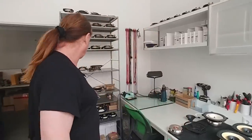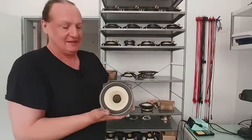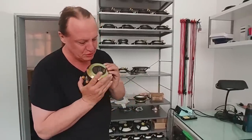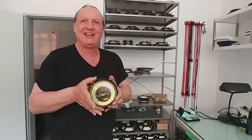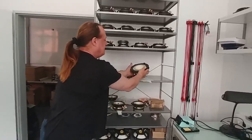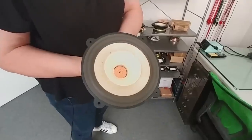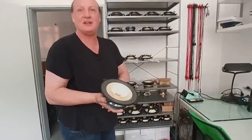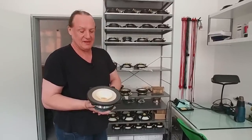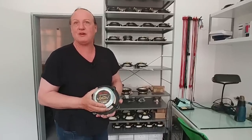We have different sizes. This is our 5-inch — a wonderful, very linear widebander — with Voxative on the back, of course. And we have the 8-inch, which is very famous. You can see that this one has a cone made of real wood. That is 100 times more stiff than a paper cone and has exactly the same moving mass. We were successful in making a cone with the mass of a paper cone, but out of wood. And we make them all by ourselves, including the cones.